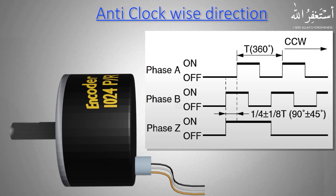These patterns of the output pulses are detected by the PLC input channel. The PLC controller can detect the direction of rotation of the encoder and accordingly can add or subtract from the current position or the degrees of the encoder shaft.